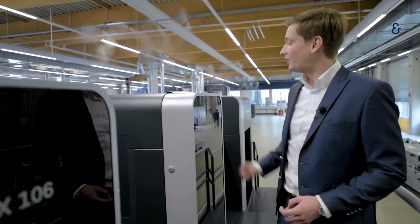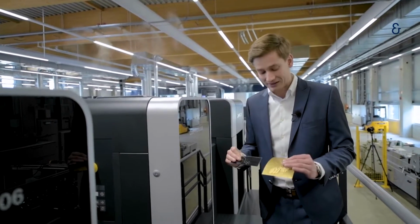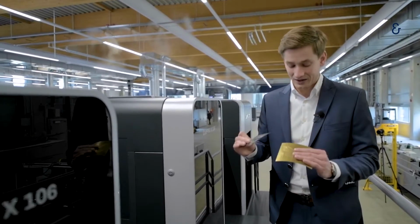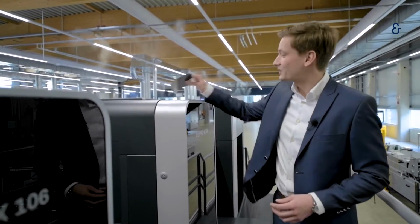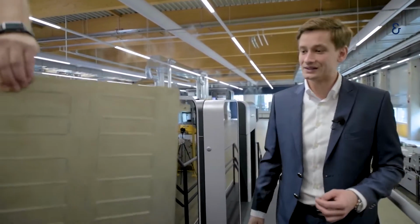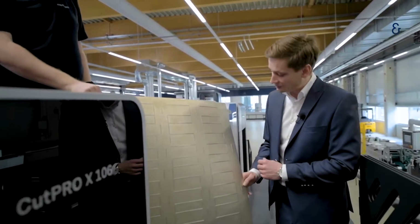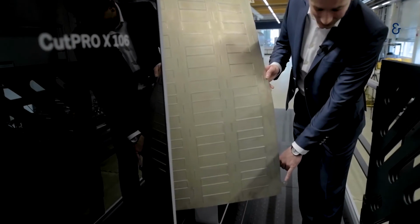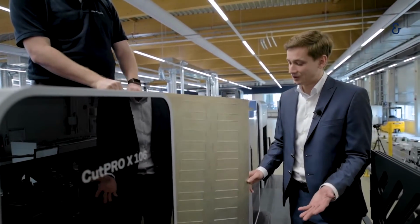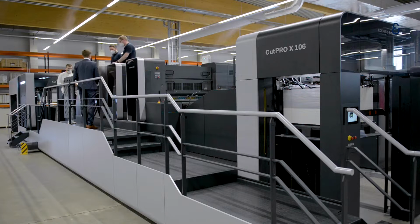And here our first process step, the embossing. The embossing unit with 2 magnetic cylinders, the female on top and the male on the bottom, so we can create a good embossing. The next unit, this is the same principle, 2 magnetic cylinders, and we are working with those steel plates. Those CNC manufactured steel plates with register holes in the register leashes. So it's click to cut principle. We only have to plug in the plate and we are already in registration.